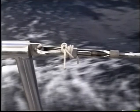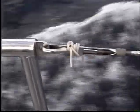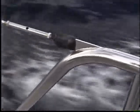Every cruising boat should have its spreaders swept aft to prevent mast pumping. This eliminates the need for forward lowers and helps with headsail sheeting. We seize our pelican hooks shut to prevent accidental opening. And I like to use a solid welded tang rather than wire bales for lifeline attachment.